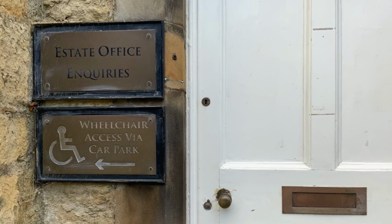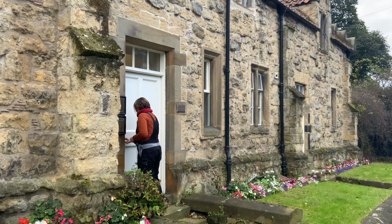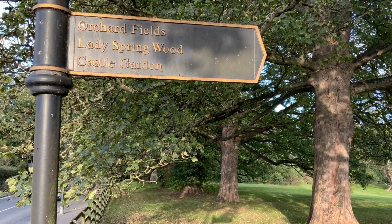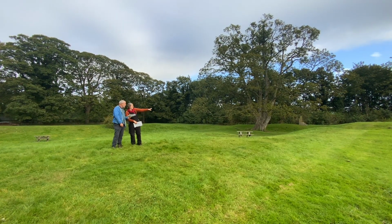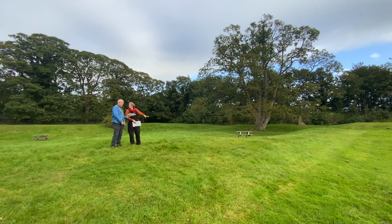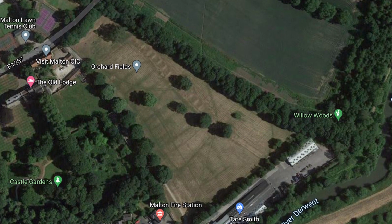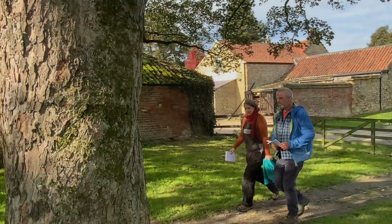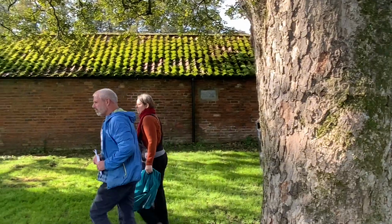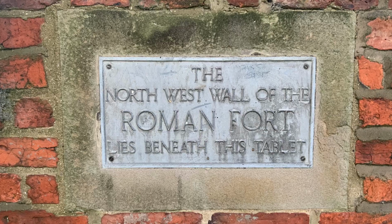The first step is to carry out a detailed and thorough recce, or reconnaissance, not only of the area you've been asked to investigate, but also of the wider environs, just to check there's nothing crucial lurking just beyond the hedge. This is called a level 1 or walkover survey, and sometimes it may be all you need to do. In today's world, it can be tempting to just look at online resources like LiDAR, Google Earth and Street View. But you should resist that temptation because you run the risk of overlooking some really important factor that you will only find out about by visiting the site in person.